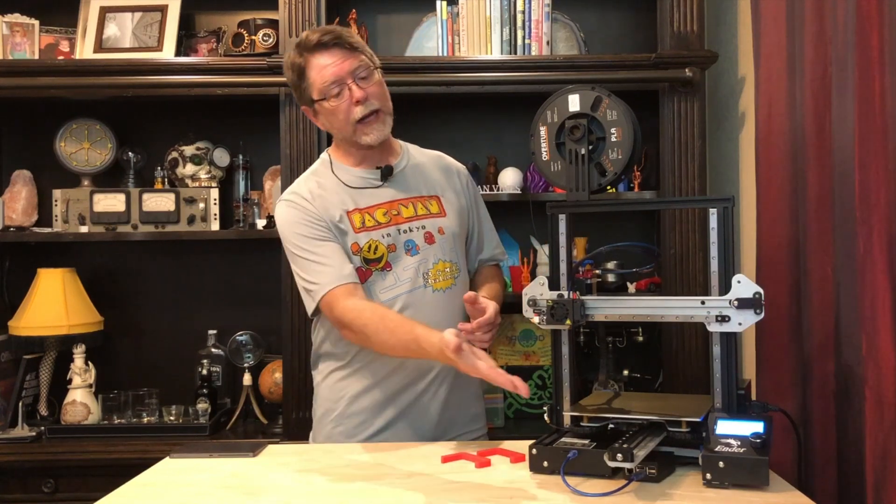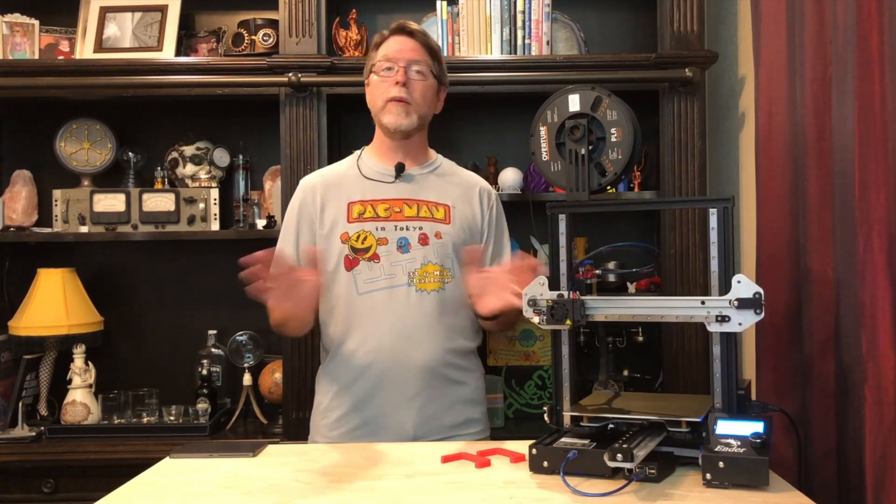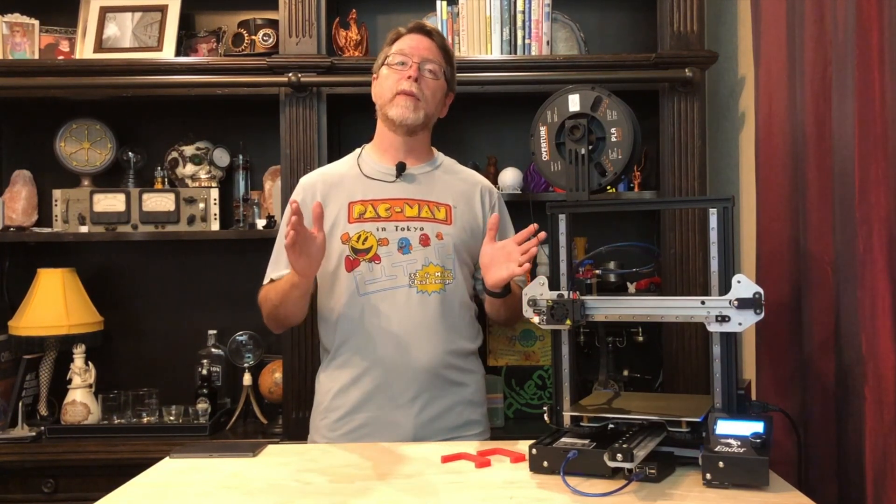I've spent a lot of time with the Y axis kit on the printer, and a little bit of time with the X axis kit, and I'm happy to report that I've had no issues. These kits are made from thick, water jet cut aluminum plates, and the linear rails are super precise, and maintenance is simple. Every few weeks I put a drop of the 3D Fused rail oil in the channels on either side of each rail, move that axis back and forth a few times, and then wipe the rail off with a paper towel.